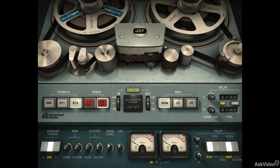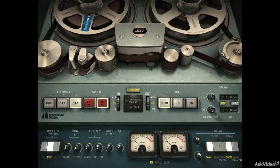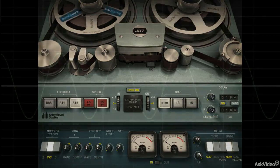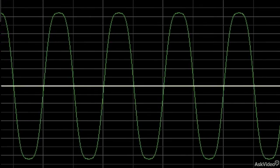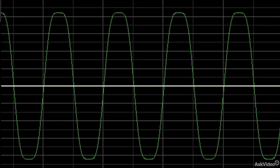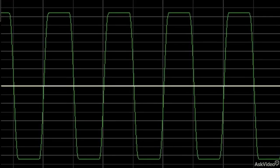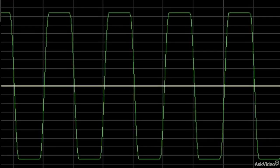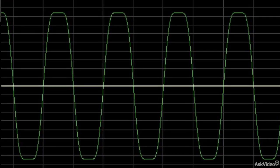Just as with all analog audio, the signal remains relatively clean and true to the original wave shape until levels exceed maximum operating levels. Then, the tops and bottoms of the audio wave are gradually flattened, clipped, distorting the original shape of the wave. If a wave continues to increase in amplitude after this point is reached, then 2 things will happen. The resulting clipped wave will fail to increase in level, compressing the signal. And the change in the wave shape will change the harmonic spectrum of the wave, adding harmonics, which constitutes audible harmonic distortion of the wave.